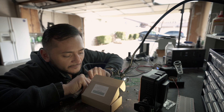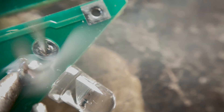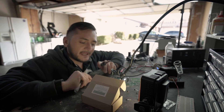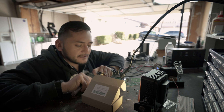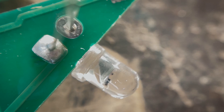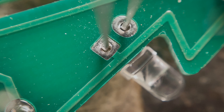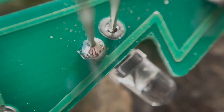Always make sure that you heat up the contact pad as well as the solder. That way, when you put the solder on, it goes right on the actual pad and the wire. As you can see on this one right here, it went right on the pad. It was very easy. Once you get the hang of that, it's pretty much how you know you're doing it right — just getting the right temperature, heating up the pad and the wire, and making sure that you melt it in there. Once it takes, it's going to take very easily.